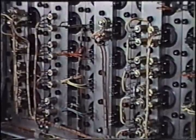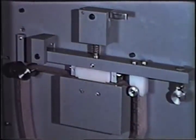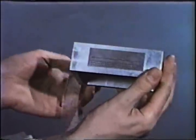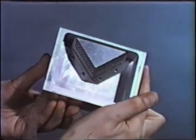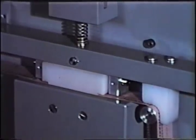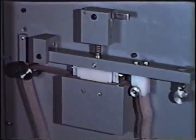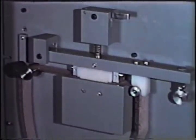The Sperry pneumatic tape reader is unique. By means of low-pressure airflow, the tape reader senses the presence or absence of holes in the tape. Brush and tape wear are eliminated, and since the air is at all times blown out of the reading head, the head is always free of dirt — adding to the extremely high reliability of the tape reader, even under the most rugged shop conditions. The Sperry tape reader reads information in blocks. One block of tape contains all command information covering a complete hole position and all other auxiliary functions that may be required, such as turret selection, spindle speed, and coolant. This simultaneous reading of the command information contributes to the high speed of the entire system. This ability to read information in blocks eliminates the shift register or memory storage unit, reduces the number of overall components, and thereby increases the Sperry control's reliability.